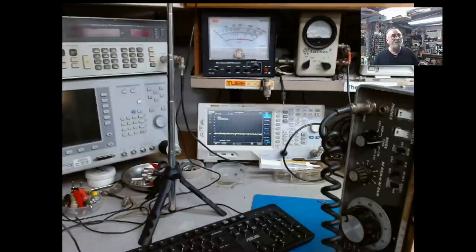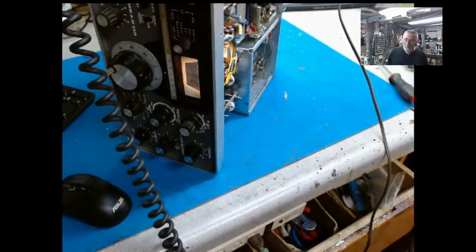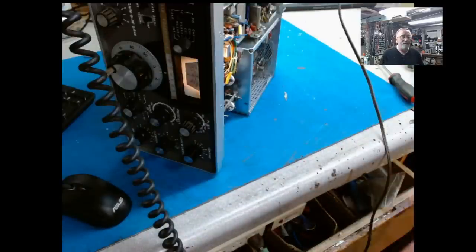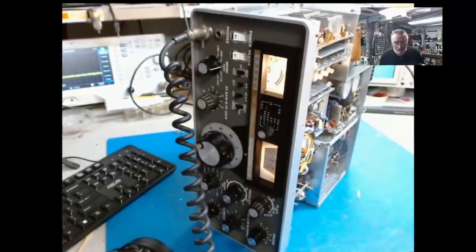When I start going full power, if the computer's so close it locks the USB ports out, and the mouse and keyboard don't work and you have to shut the computer down and turn it back on. That's because the RF is so close to the computer. I need to do something about that — either get the computer a little bit away to test it, or try to put some grounding and ferrite beads on it. It's sitting just right there, and RF will affect computers.